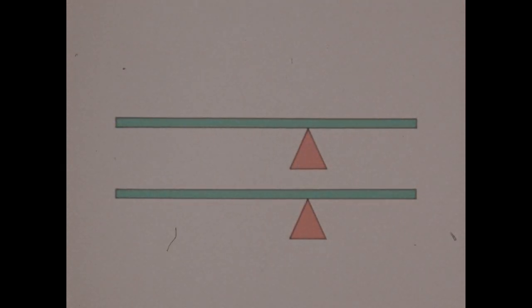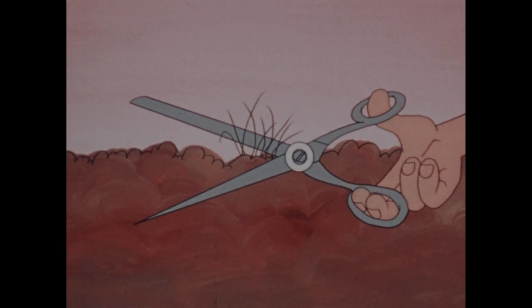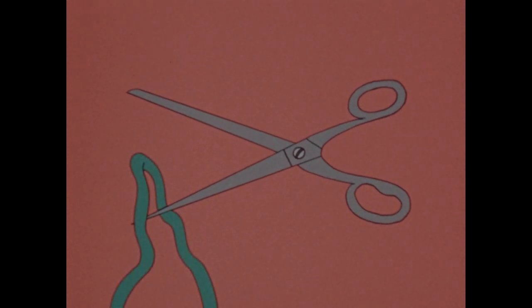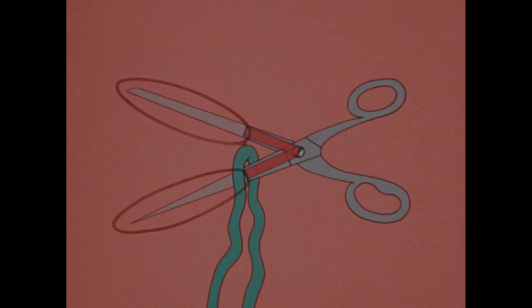Now, suppose you take two of these levers and join them. That's how the levers are in scissors. The screw is the fulcrum for both levers. In these scissors, the load arms are longer than the other arms, so the force the scissors cut with is smaller than the force you apply. Is there a way of getting these scissors to cut with more force? You can't move the fulcrum, but you can move the load. Now the load arms, from the load to the fulcrum, are shorter. The levers work as though the outer parts were no longer there.